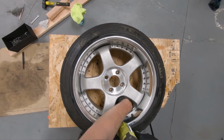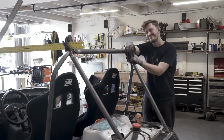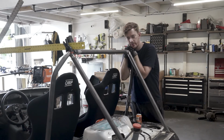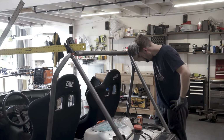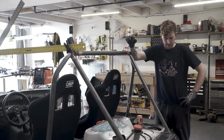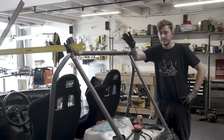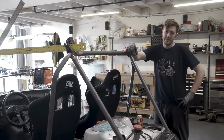So the secondary brake caliper is mounted, the lines are all run. I had a leak in the very first fitting on the master cylinder on the e-brake handle, and I think it was just because I'm really bad at bending copper pipe. So that's almost done. But I stripped the paint on the wheels. I was going to paint them glitter sparkle teal, and I decided that we should try it out silver, because the stripping process was a goddamn nightmare.